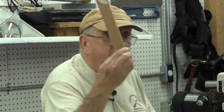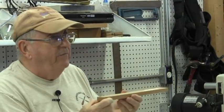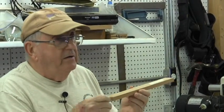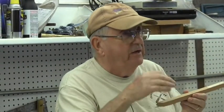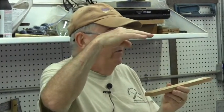Truly, the hardest part to get ready to do this is the mill work, to decide what you want, how you're going to cut your starting pieces. Do you want it 3/4 of an inch? Do you want it a 1/2 inch? Do you want it 1/4 inch? Sometimes when I do them, I make 3/4 inch couple rows. I'll do a 1/2 inch row thickness, and at the top I make them 1/4 inch row. And just because it changes the design. It's not mandatory. Okay.